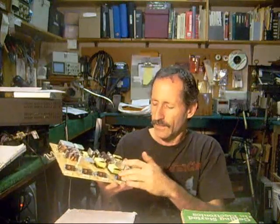If you're new at this or trying to improve your troubleshooting skills, a lot of times you'll have a component go bad on a board and you may not know how to test it. For example, you may have an opto-isolator which is used in a feedback circuit. If it goes bad, you're not going to know it just by visually looking at it — you've got to run a test. Take your volt-ohm meter and see what kind of resistance it has going across the different junctions. I recommend you start taking notes of different boards that you've worked on. If you've got an old junk board with parts like a transformer, opto-isolator, or diode, write down what kind of resistance you have going across the different junctions. When you go back to working on another set later, you'll be able to compare readings and get a general idea of what to expect.